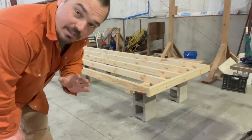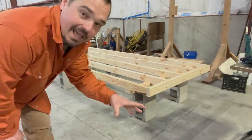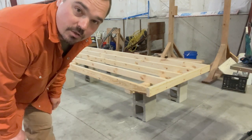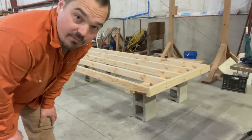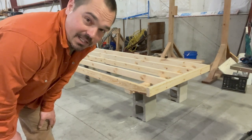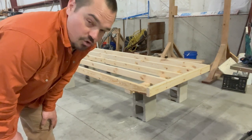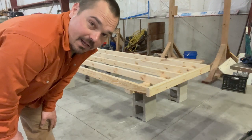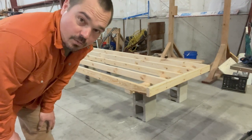That's a big thing I messed up on my first boat. I was just hammering heat into certain spots and it got all warpy goofy, and that's no fun. So we're going to be a lot more careful on this build. I'm going to jump around to where I'm putting heat and try to keep this thing as square as possible. We're going to add some straightening bars too. We'll tack some stuff on to keep it rigid so it can't pull and warp when we're doing the transom and some other stuff, sidewalls, that sort of thing.